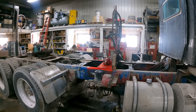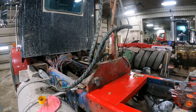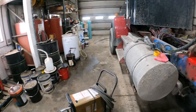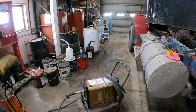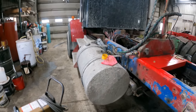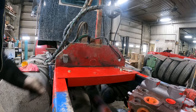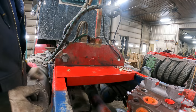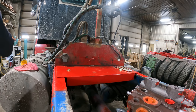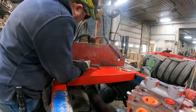We have our hole marked out. We're going to cut that round hole in that vertical plate and we're going to use this Hypertherm Powermax 600. I got this plasma cutter on eBay a few weeks ago — we'll go ahead and put it to use again here. What I did is take and trace out a hole saw. I don't really want to use the hole saw because this material is quarter inch, and I just don't want to spend the hole saw on drilling through material that thick. So we'll go ahead and punch a hole in here.